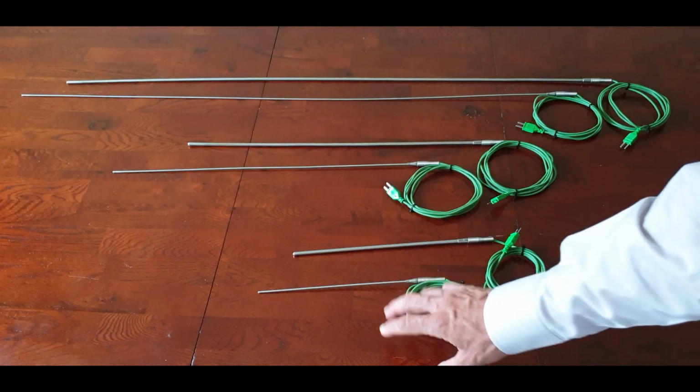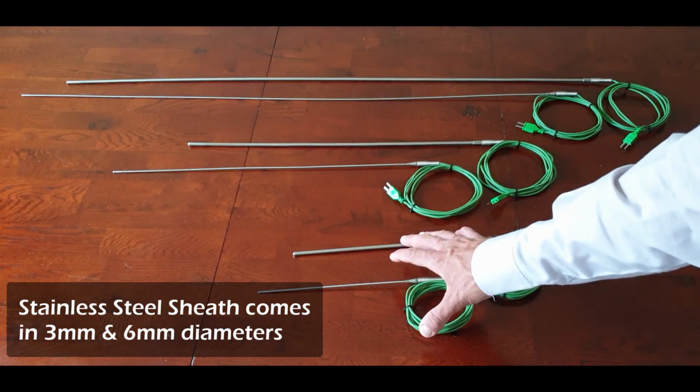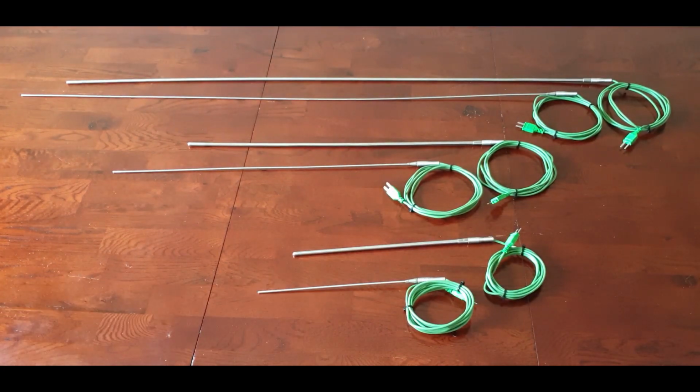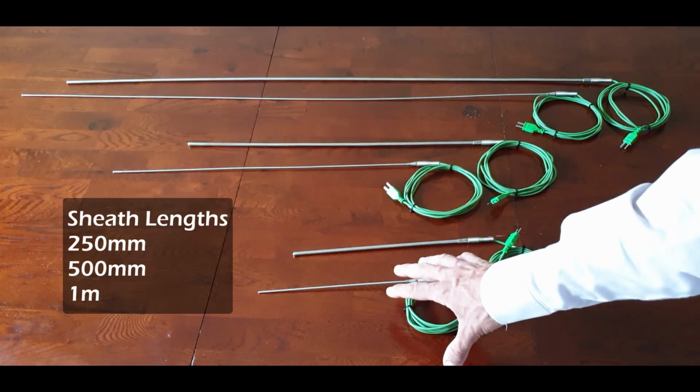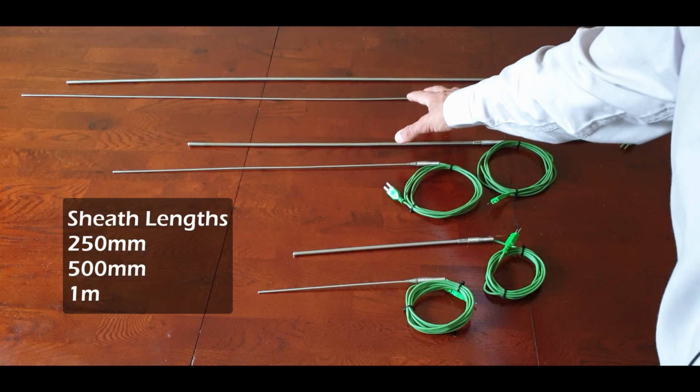Hi, my name is Zico at Alpha Temp Technology, and in this video I'll be taking you through a range of high and low temperature mineral insulated K-type thermocouples. The probe sheath is made out of stainless steel and it comes in two different diameters, 3mm and 6mm. And they come in three different lengths, 250mm, 500mm and 1 meter.